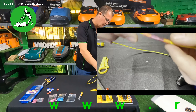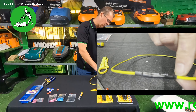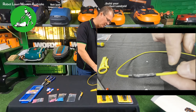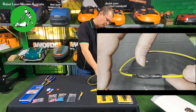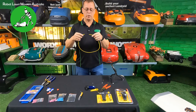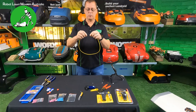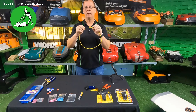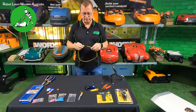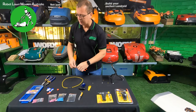Do the same with the resin-filled heat shrink - start in the middle and work your way out to both ends, making sure you heat up on all sides, not just one side. You'll end up with a nice sealed joint. It doesn't matter if it's not perfectly centered as long as it gets down onto the wire and the glue pokes out a little bit on the end to seal it. That is the crimp joint done - not a lot of tensile strength, but a pretty strong connection that is waterproof and you won't have to worry about again.